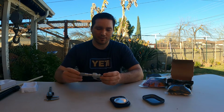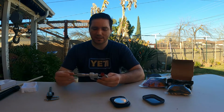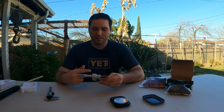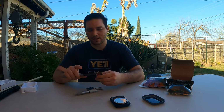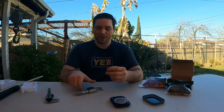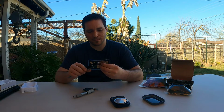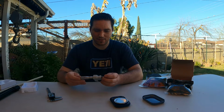Now for the Wrap 4, we'll measure these out. You're looking at 0.6776. 0.67705, and then for the length, 0.670 in length, okay? These fins are gonna be a little bit hard to measure because this is thinner around this bezel here, so it does flex. So I'll do it with the calipers, or you know what, we'll try it with the mics and then the calipers as well. Just get a few different measurements.